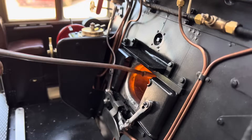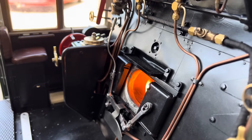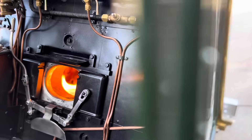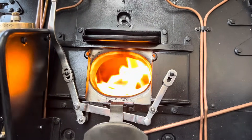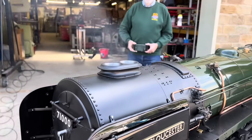Charcoal lit — there's already a bed of charcoal been put into the fire box itself, so that John's lit piece will light the charcoal that's in there already. The forced air that we've just drafted up the chimney will pull that forward and through the tubes. That's why the smoke isn't pouring out through the fire hole door into the cab at the moment — it's being pulled the right way and blasted up the chimney by the forced air induction.